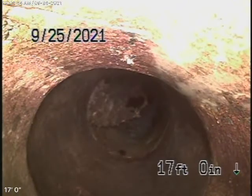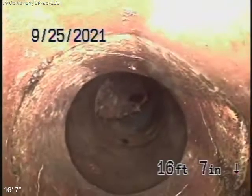So we're now at the 4x6 connection. At the property line, you can see it comes back. There's some finer little cracks in the line — very minor. The pipe looks like it's in pretty fair condition, in my opinion. Those roots that you saw are not going to cause a blockage; they definitely can be easily cleaned out. Outside, the 4-inch and the 6-inch clay pipe look pretty fair condition.